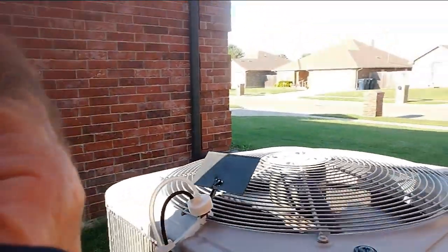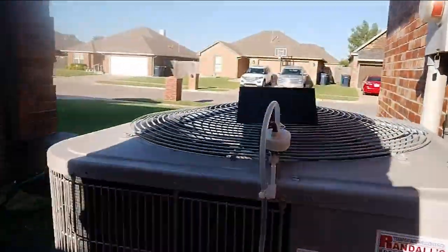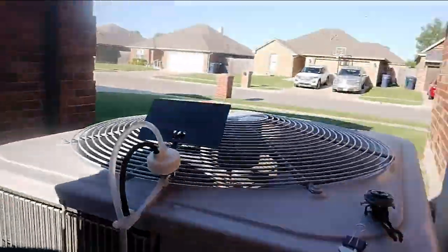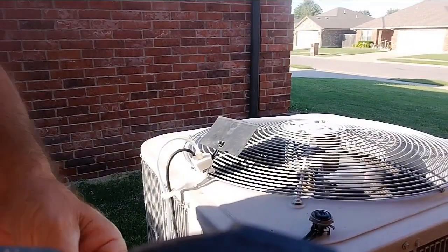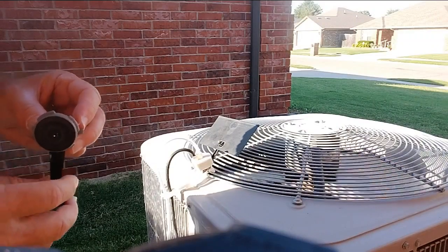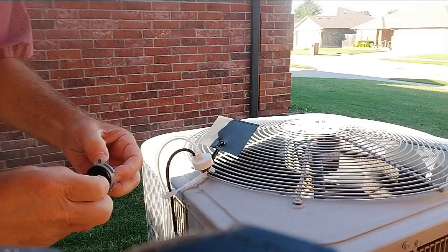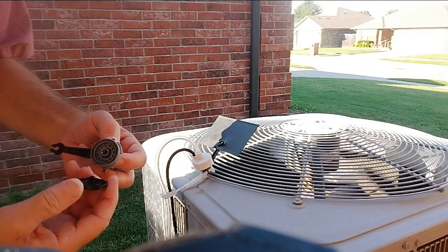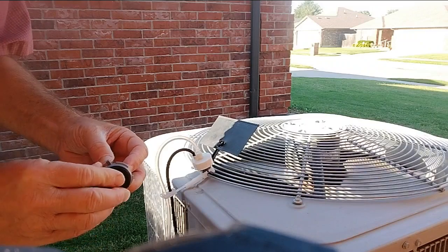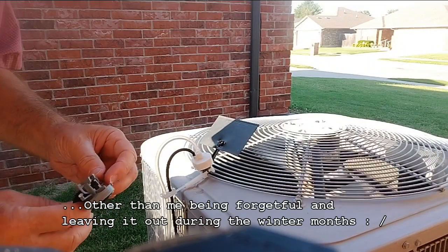Water back on. Some spraying action. Looks like they've shut off good. I've put some silicone grease in this several times over the last few years. I believe I've replaced the seal on this as well. And I wouldn't think much else could go wrong. It has quite a bit of resistance. The rubber may have just swelled up and is hanging on to that needle.